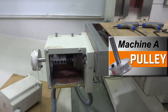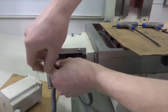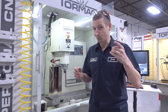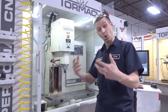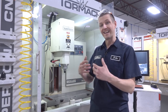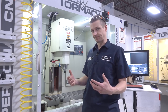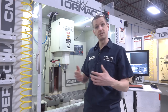Keep your tools handy because we're going to put in our pulley. This is from the Wednesday Widget on making this device — shout out to Robert — nothing short of genius for its simplicity and doing this scientifically and not by feel. Just snug them up. Where are we at? I've loosened the gib, we haven't adjusted the angular contact bearings yet. One of the things that is nice about this pulley is we're able to now feel the machine. My goal with this video is to use more science and less feel, because science gives us repeatable values like torque numbers. Nevertheless, feel is awesome. Right now I can easily rotate this machine, but that doesn't tell us much because the gib is loose — there's not a lot of friction in the system and we really couldn't machine like this because the table would chatter.